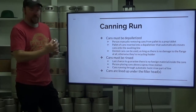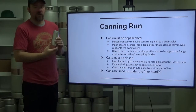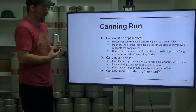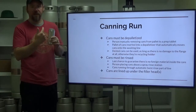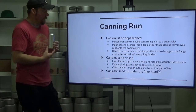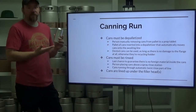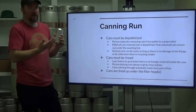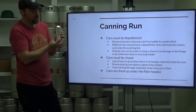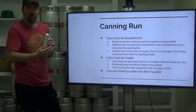You don't want to use a can where the lip is damaged in any manner, because that is going to lead to false seams or issues with your seam — wasted product and hurt reputation. If you've got a can on the shelf slowly leaking, that's a wasted can, a wasted sale, and reflects very poorly upon the brewery. If your can is dented, draw a line at some point. Anything in the middle is going to get covered with a label anyway. If it's got a little purse on the side you can push it out and it'll be fine within reason.